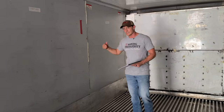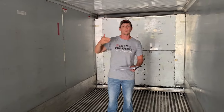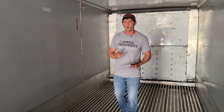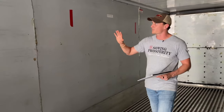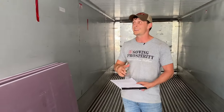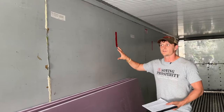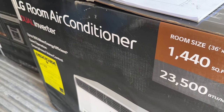We will build a partition — not sure if we're just going to do the hang-down plastic or make a door there — but it will be insulated. This next section is going to be about 17 feet, and our target there is going to be 48 degrees. That 48 degrees will be coming from the same air conditioner unit we use in the back section.